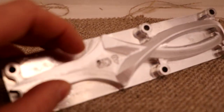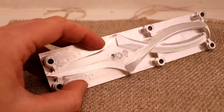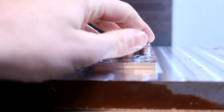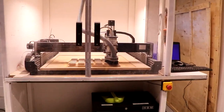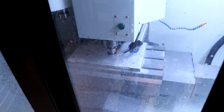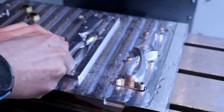And you can see in the video there were some things wrong with the blade. And also the engraving was too deep. So while I had the bottom side of the blade done, I tried to fit it in a mold that we made last episode, and it wasn't completely fitting either, unfortunately. So we had to remake it, do a little bit of a wider step over on the mold to accept the machined part, and then remove some burrs with some knife making stones, some mold stones, and then we were able to fit it.